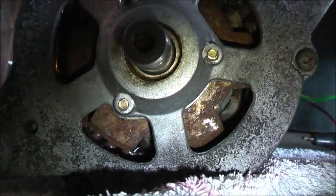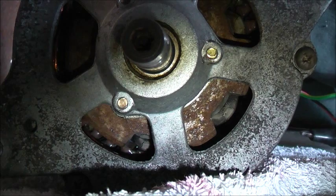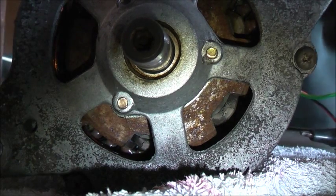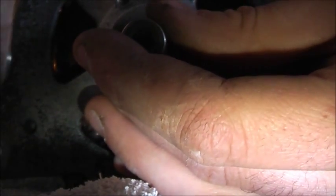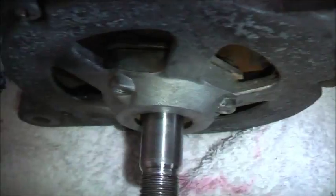All neutrals are tied off to neutral, and each phase goes into the coils in there. I do get a little bit of response on this shaft — I'm getting a slight twitch on that shaft when I turn this thing by hand, so it must be working to some degree. We're getting something out of it. Reconnect this third phase here — I haven't got an alligator clip on this wire, just got to make do. Re-excited again — it's got to turn fast enough. You can see the shaft there twitching backwards and forwards as I'm turning it. I can feel the shaft moving a bit. It is working — you can just see it twitching there. It must be hooked up alright.